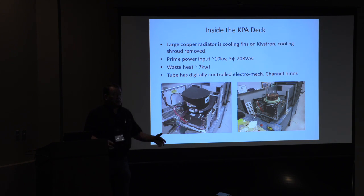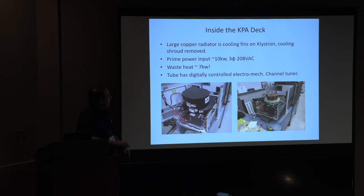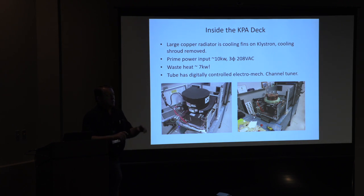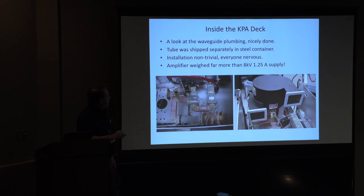The Klystron was shipped to us in a big steel box — a whole pallet by itself — along with the amplifier assembly and the power supply. What's cool is the Klystron power amplifier has mechanical tuning to tune the cavities to different frequencies, and this is all digitally controlled now. They've got an electromechanical tuner, so you just tell it where you want to go in frequency and you're right there. They have a bunch of different tubes that will do different frequencies; they selected one for us and we got the thing programmed for our channels. It turns out that the Klystron has 45 MHz bandwidth, but our transmit band is 90 MHz wide — so if it had just been double that we wouldn't have needed a tuner.